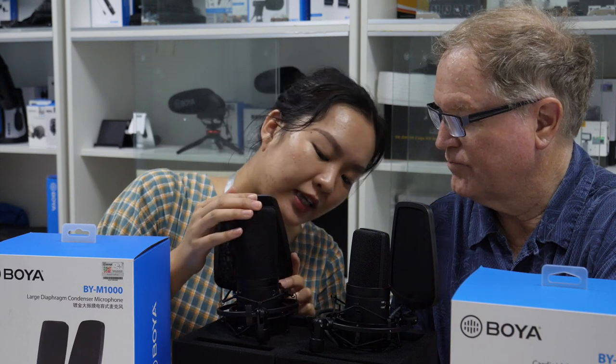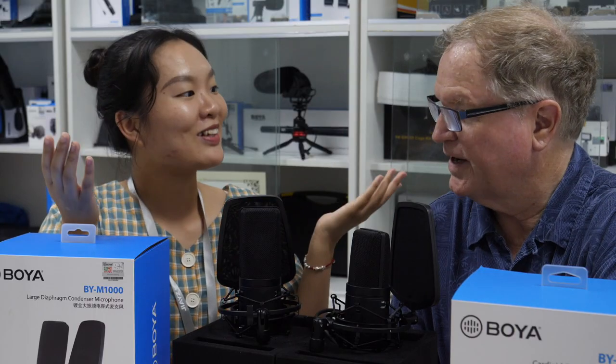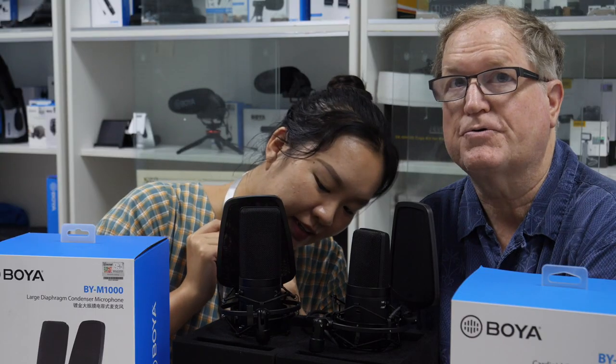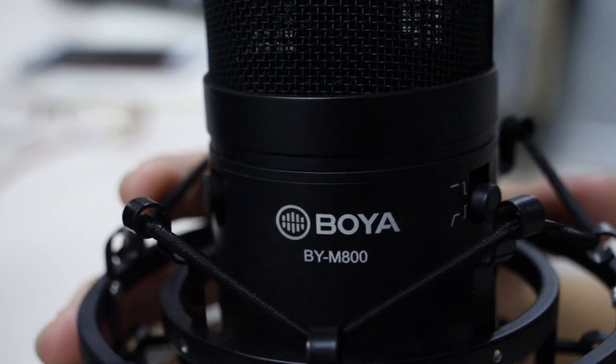Another feature is the low-cut switch. If you turn on the low-cut, it takes out some of the bass. Both of our microphones right now are in low-cut mode, because when I listened to them earlier on headphones they sounded pretty low — at least my voice did. The low-cut switch is good for voice recording; you'll want to turn off the low-cut if you want to record music.